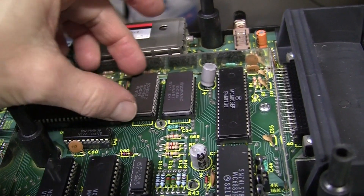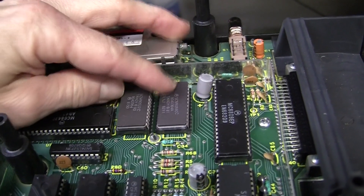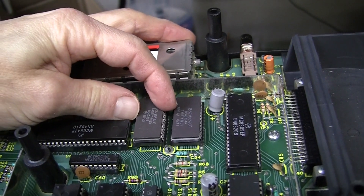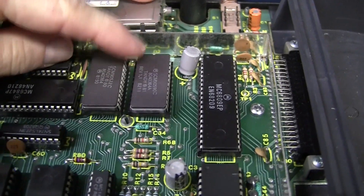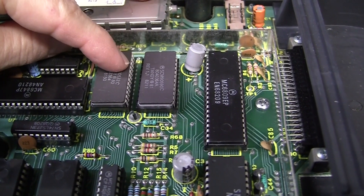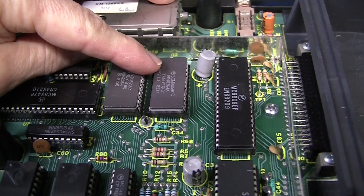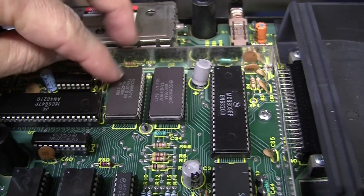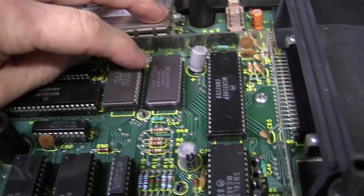A lot of adapter boards are a little wider than the space we have here, so I came up with a couple of options. At first I made a really narrow adapter board, and then I thought maybe I could replace these with a single board that picks up the chip selects of both slots and uses one ROM. That way the board only has to fit in the space of both sockets and only needs one EEPROM.